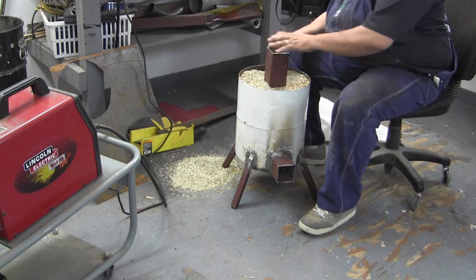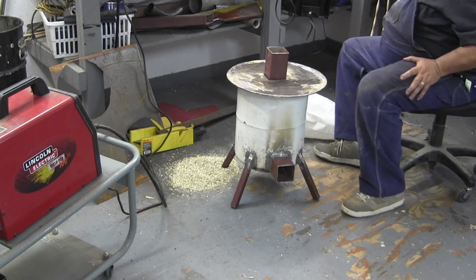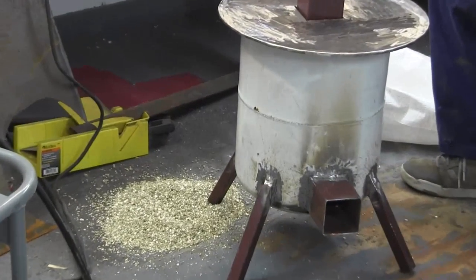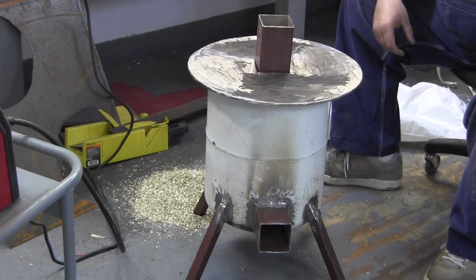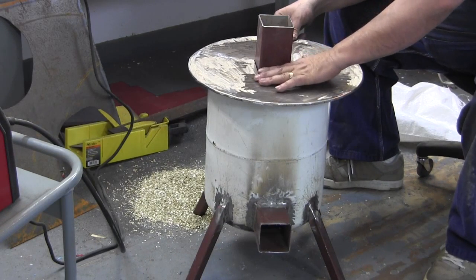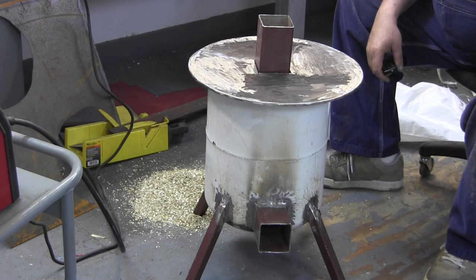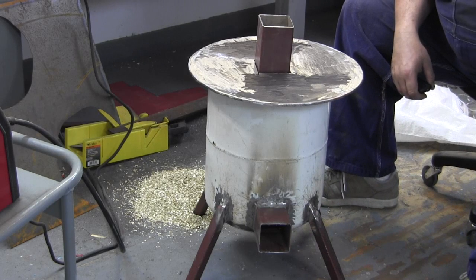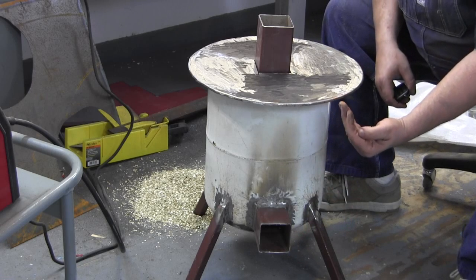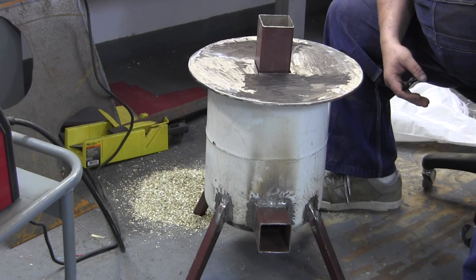I'm going to sweep up what I spilled down there and put it in here. Here's what the top is going to look like. I'm going to weld this, cut this off even with the top of the plate here, and then go around underneath and weld all around the edge of this. Hit it with some black spray paint. I've also got to make a floor plate for in here — it holds the sticks up off the bottom of the combustion chamber, because what you want is the air to go in under the sticks and come up in the front of them, which would be in the very front of this burn chamber. That is what creates the wood gas and gives it the rocket effect.